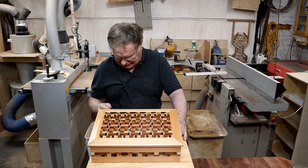I had to do that about ten times to get it down — it came out good. Over to the saw to cut the 15-degree angle on the top now. I've got a jig to do that, so I cramp it down — you can't hold that. Just keep rotating it and go fairly quick so it doesn't burn. Taking it over to the box now for a first look at the angle on the lid. Looks great. Spraying it up now — look at that centre panel, look at that red in the centre panel come up.